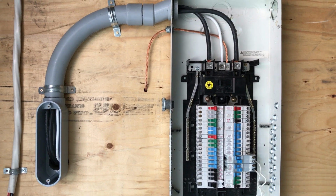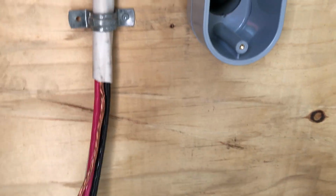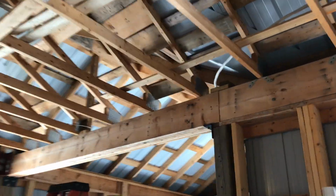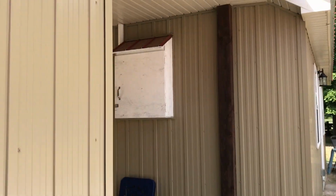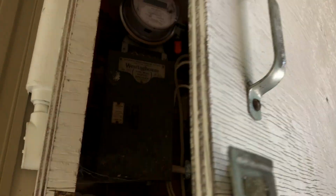Okay? So that's that. Now I got the 100 amp. This is a 3 conductor, number 3 Romex. Okay? And I ordered 75 feet of it. Which, this is, you know, another situation where I measured it, and I measured it based on this distance, and I allowed for like 8 feet down there and 6 feet overhanging over there. I'll show you where this Romex is going to end up. It's going to end up coming out of there and tying back into here.